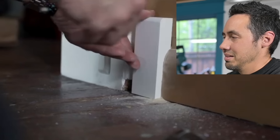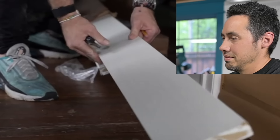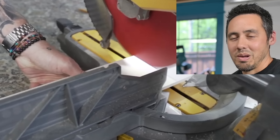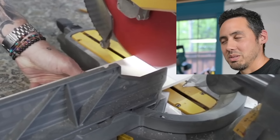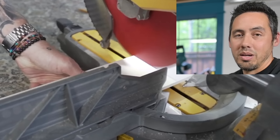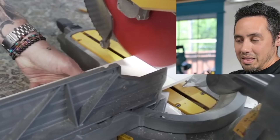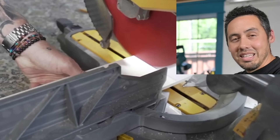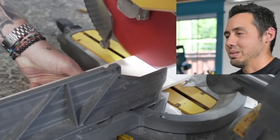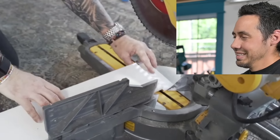The video shows measuring the distance and cutting the cover trim. Let me stop here — this is a pet peeve of mine. I made a video on this a couple months ago: when people cross their arms at the miter saw, it's very dangerous. I had several carpenters chime in the comment section saying yes, you are absolutely right — people had the blade come at them and hit a tendon, cut their muscles. Every time I see that I cringe. Don't cross your arms at the miter saw, it's just asking for trouble.